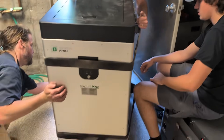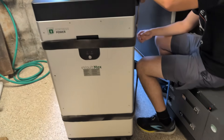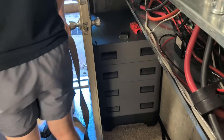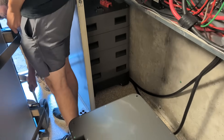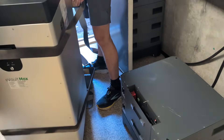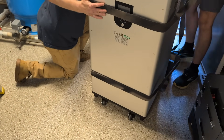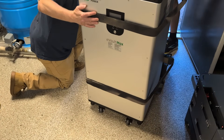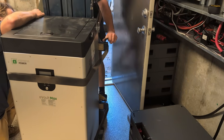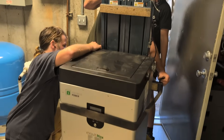We're going to get the Fortress batteries on my truck and return them — I've got another customer that wants them. Then what we're putting in place are these Stack Series. We're going to give this customer 16 of the Rubik's Stack Series. These have done really well, and they'll give us about an 82 kilowatt-hour battery bank. He had 18.5 before, so this is going to more than double his capacity, which is what he needed to net zero this property.